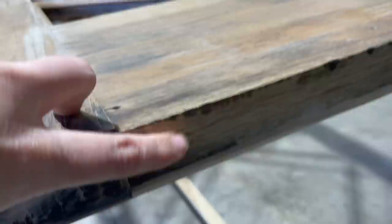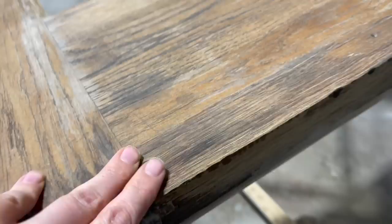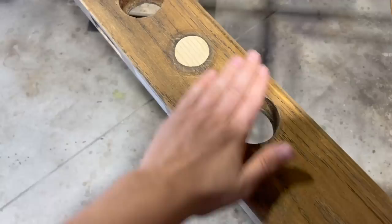And this wood is super, super hard. This is a solid oak door. It's not a skinned door. So, you know, usually you can see like a solid core and then you'd have a door skin on top, like an 1/8-inch door skin. But this is a solid oak door and this oak is hard, hard, hard. So it eats my sandpaper for breakfast. And it takes quite a bit of pressure to get through this patina. And that's good because you want a hard wood for your door, but it makes for tough sanding.